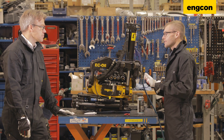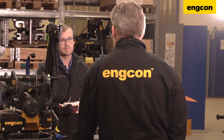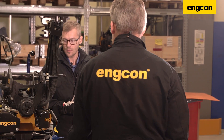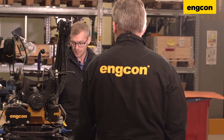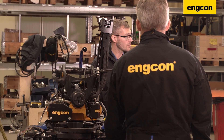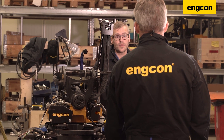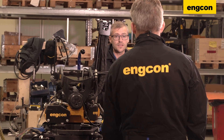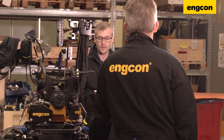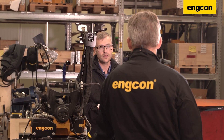That green buildup — is that corrosion? Yes, that's corrosion on the connector. So to summarize everything for electrical connections: take them apart, clean them, make sure all the seals are in them, then put the electrical grease — and make sure it's electrical grease, not just any kind of grease. It's dielectric grease purposely made for that purpose. Then just put them together again.